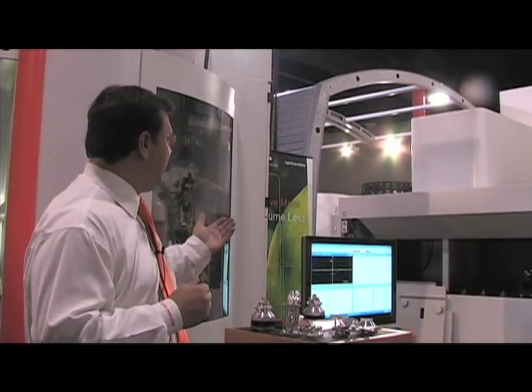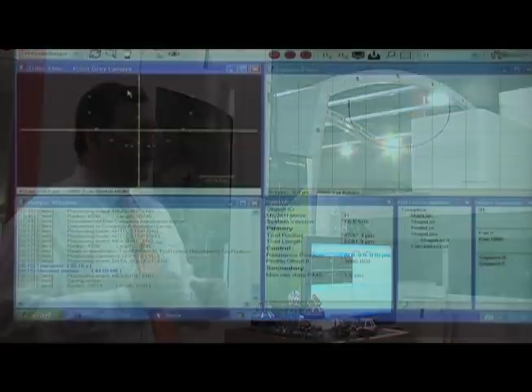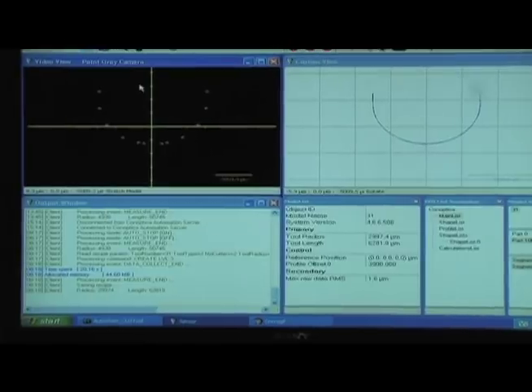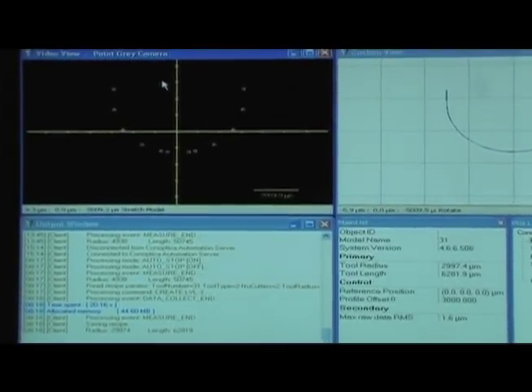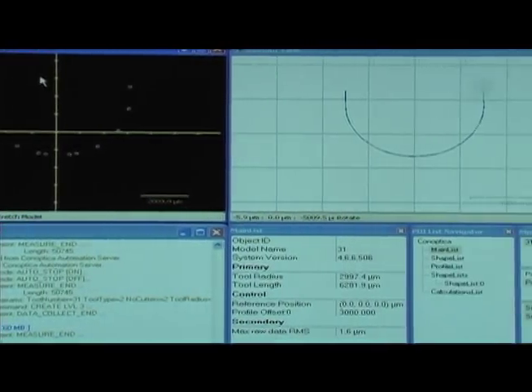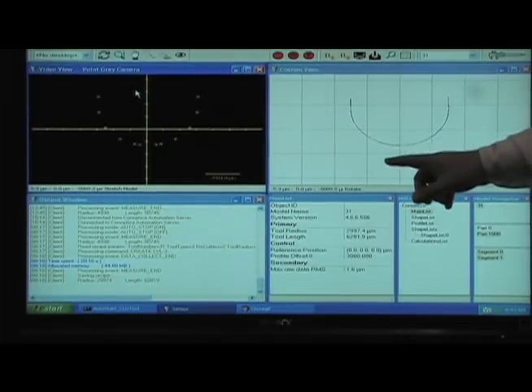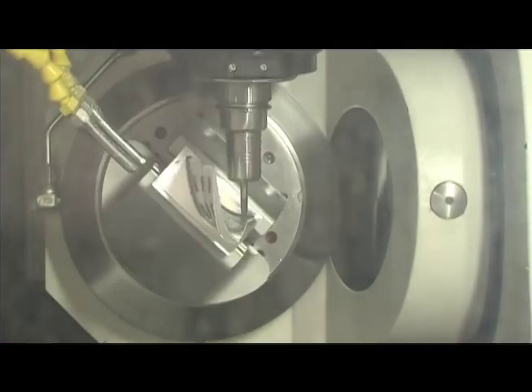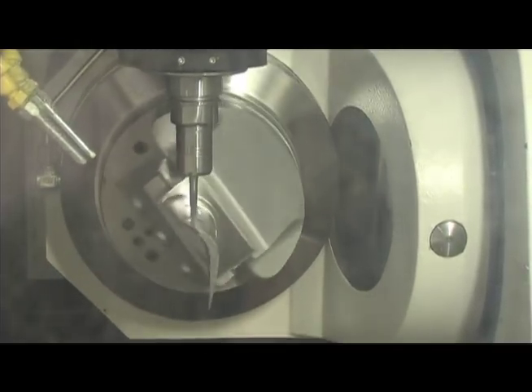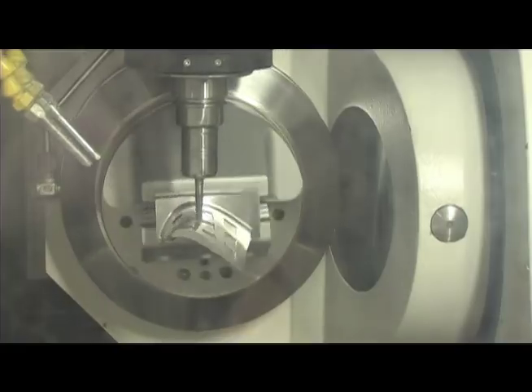The software is inside the machine, so normally you don't see it. But here in the black area, it actually takes a photograph of the tool and then measures it against a CAD system to pick up all the XYZ points. In this last measurement, for example, I can see about 20 points on a ball end mill — those points are calculated and fed to the machine so it knows exactly where it is in XYZ. Z is critical here in order to maintain depth. This tool is performing a surface finish on the blade, and at the far end, another tool will make the blend between the fir tree holder and the blade itself.